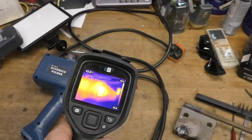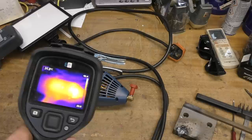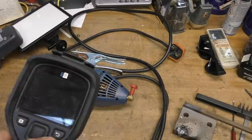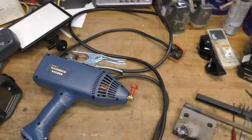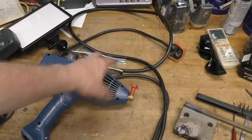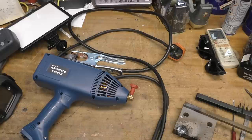This has been off for about 5 minutes and looking at the internal temperature, that output transformer is still about 45 degrees - about 20 degrees above ambient. This does have a limited duty cycle but the only thing really enforcing it is the thermal trip on one of the IGBTs. Because that transformer has got a fairly big metal core with higher thermal mass, if I was to guess what would eventually die from overuse, it may well be that transformer might melt down. The IGBT is right in front of the fan, but there's less airflow by the time it gets to the transformer windings.